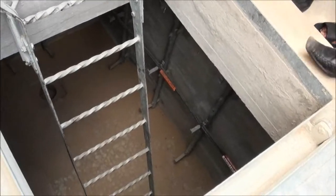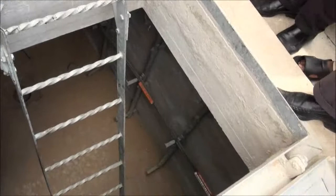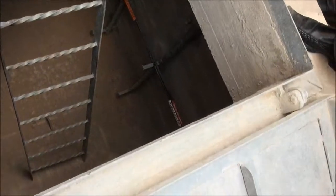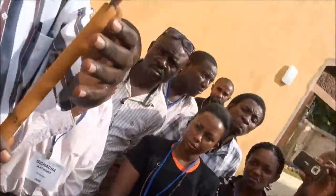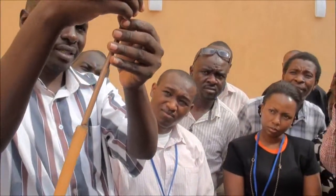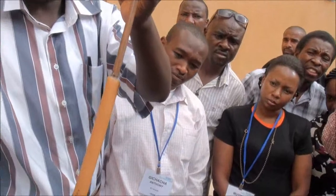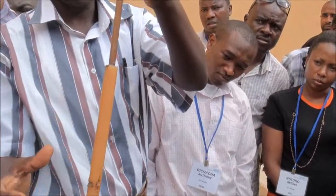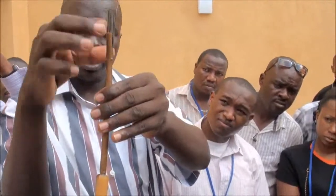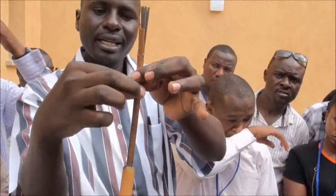Let me show you the way the fiber is. The cable labeled 'C cable system' is the cable going into the sea. These are the fibers — all this outer layer is protection. There are six fibers. These are from three different countries. This cable is called double armored, SL17 double armored. The first and second armor layers are protection. But this part here is a power conductor — it is the positive part of DC power that is powering the repeaters.